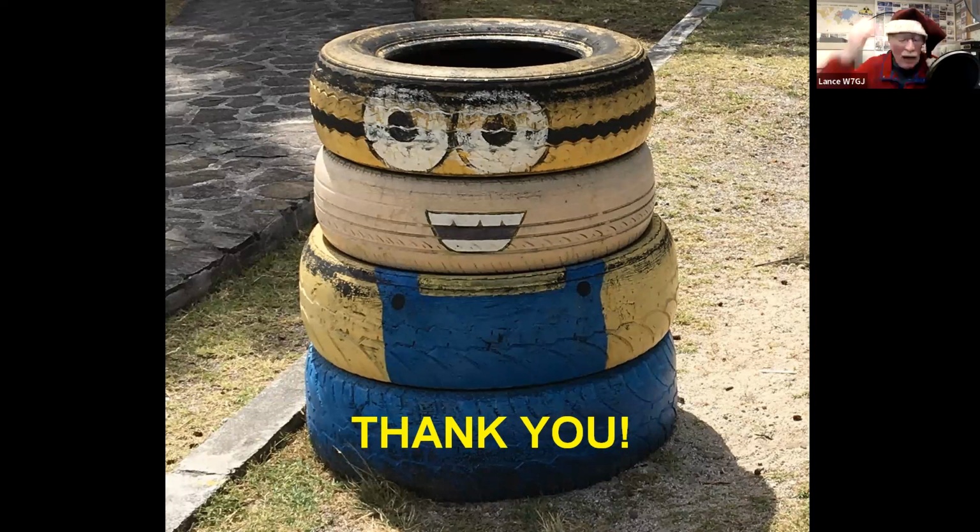I do have a problem when I put it on the horizon, around 15 or 17 degrees, and elevate it up to about 30 degrees. The modeling of the lobe is very erratic and basically unknown because of the terrain and the height. It is above the ground. The ground has a big effect, and the local terrain and hills have a big effect. The bottom line is that the antenna's lobe is not pointing where the antenna is pointing.